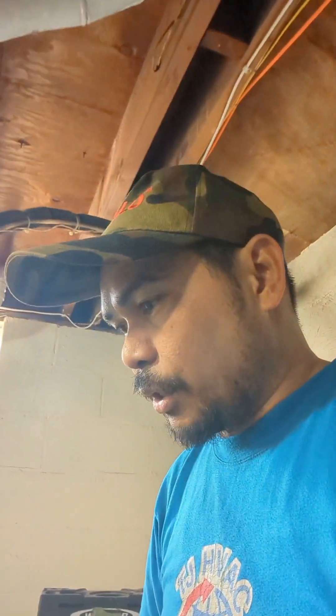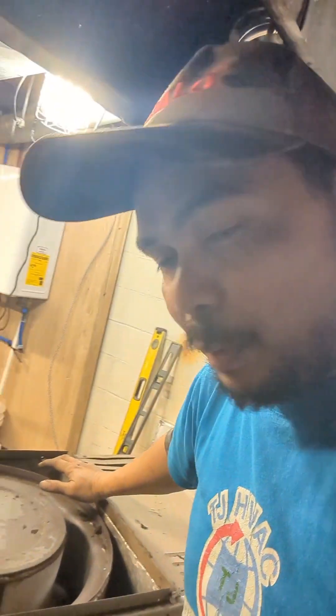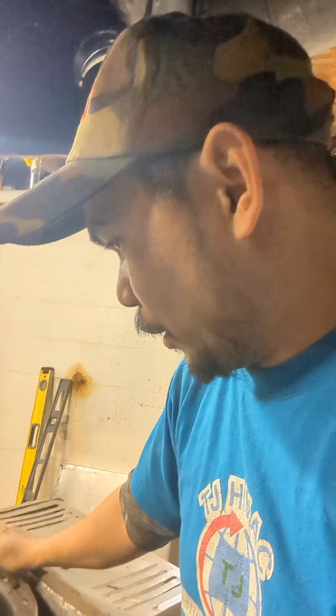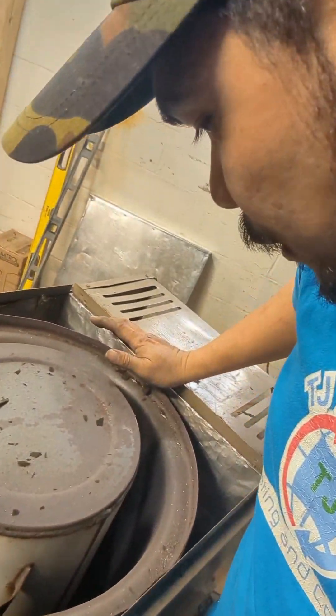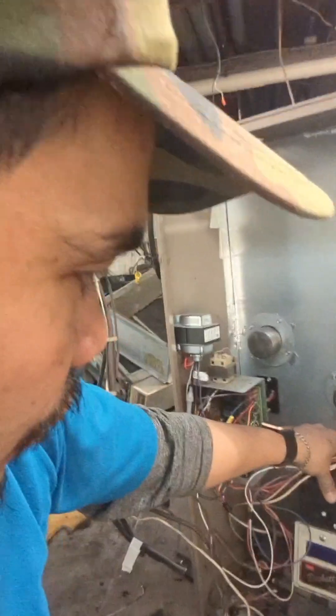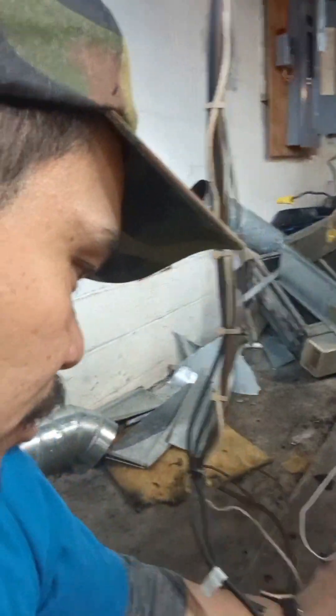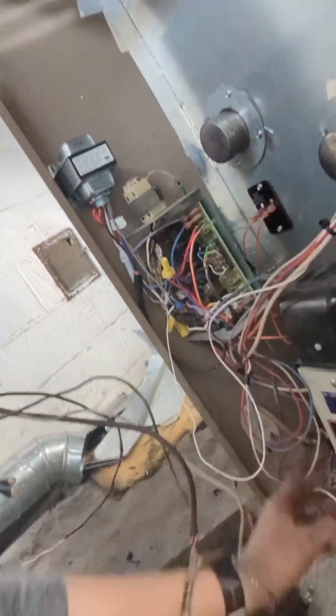You have to make sure the people doing the tune-up are actually honest. He said the guy that came here did an inspection with a camera and showed him the crack in the heat exchanger. But looking at it, it doesn't seem like there's any crack. A lot of times this stuff is just not being cleaned up properly. There's a nozzle here — looking at the burner, this is where the oil is, and this is the air intake.